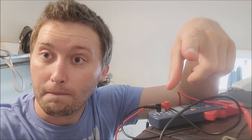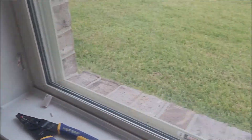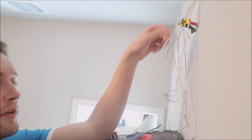One thing to be aware of: dual windows that are close together will likely share just one zone wire in your closet. That means if either one opens, it triggers the single zone. Also, I have a high-powered magnet I got on Amazon — a couple of my doors actually do have a magnetic sensor already behind the weather strip, just a little plastic circle. You can buy those on Amazon as well. One of my doors doesn't have this, so I'm just going to use the Ring stick-on sensor for that one.